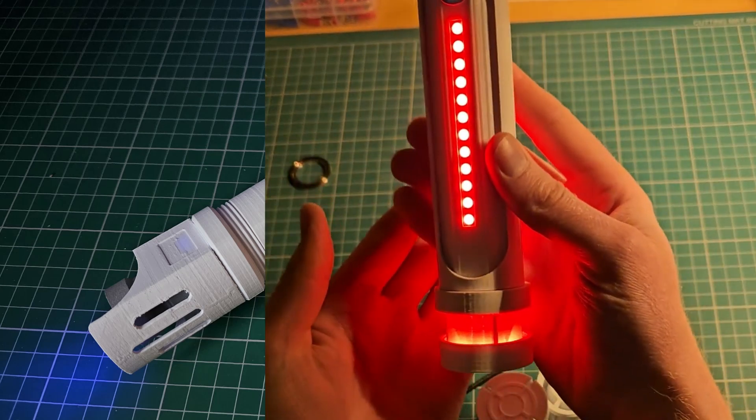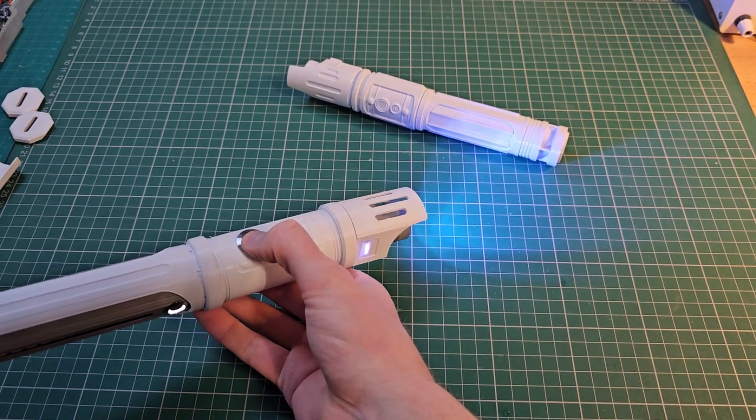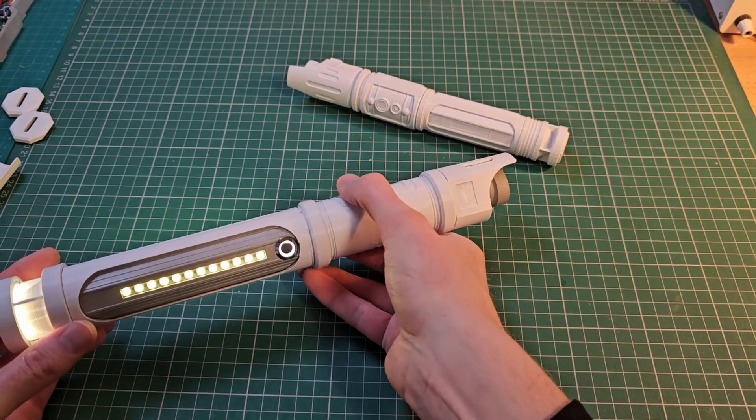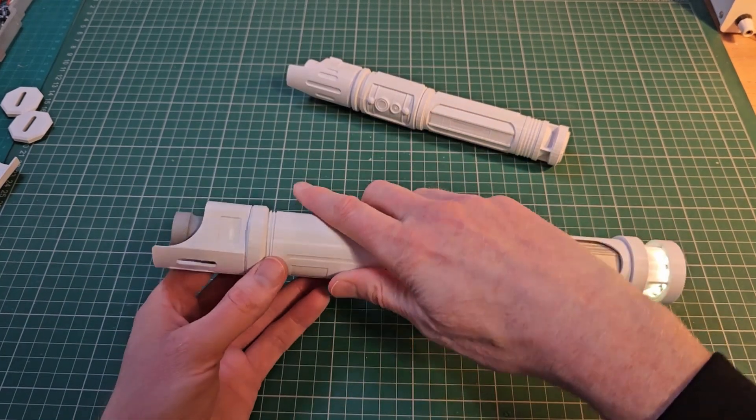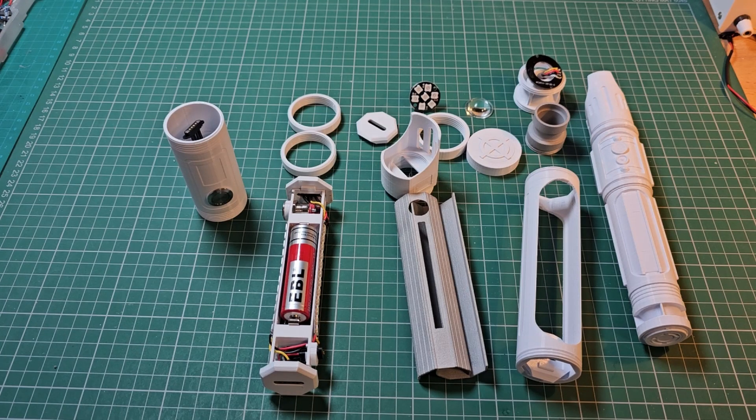I added another push button for secondary behavior, linked to turning the controller into a flashlight by fading all the NeoPixels except the emitter and changing the emitter to full white. I also wanted to include a presence sensor to dim the NeoPixels if no motion was detected, so I attached an RCWL microwave sensor. This sensor takes a 5V input but also includes a 3V output which I used to power the joystick. I couldn't pass 5V directly through the joystick into the Pico pins because they only accept a maximum of 3.3V, so this was a good option.